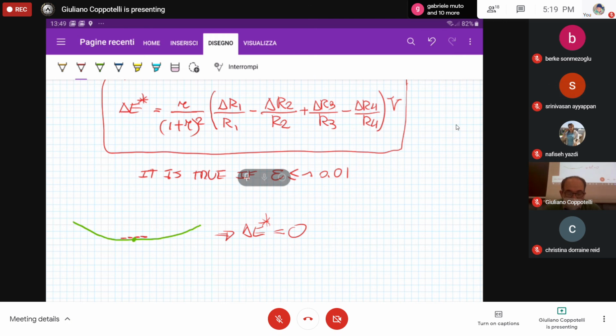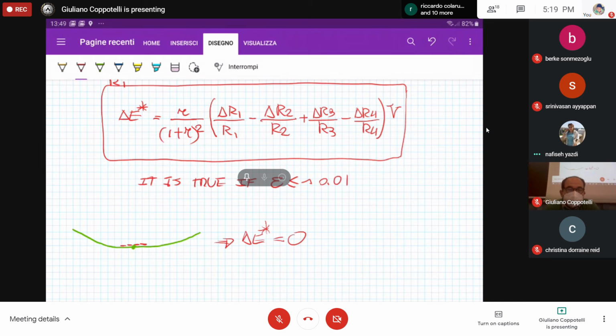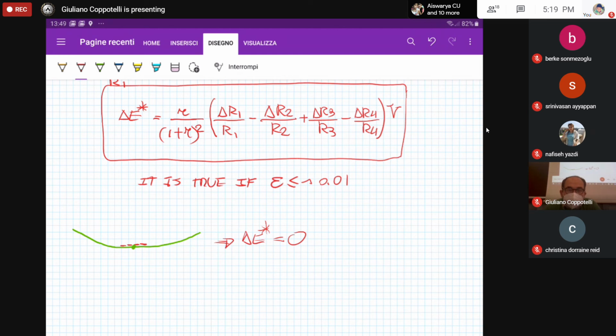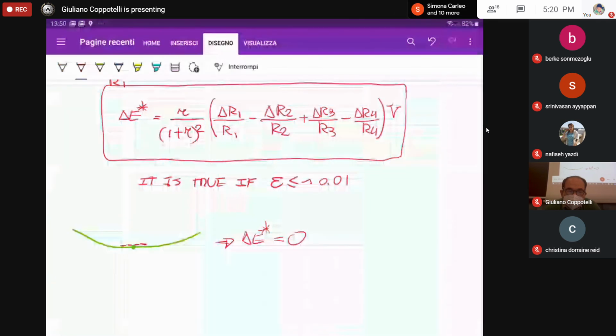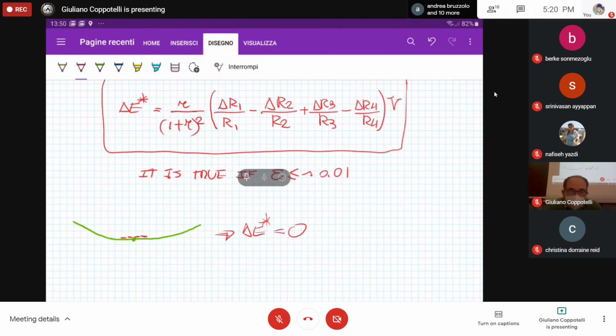Other clues, other ideas about that? Can you make your question a bit clearer for me? I really didn't understand very well. Yes, the question is, considering the previous equation, the bridge equation, and considering that I would like to measure the strain using 4 strain gauges like the one that I drew on the picture, how can I do that? Because if I do that, then the output tension is 0, so I can't have any information at all. So the question is, how can I use 4 strain gauges at the same time to measure the strain?